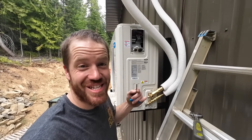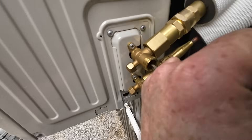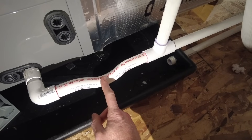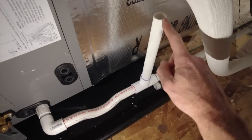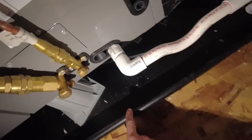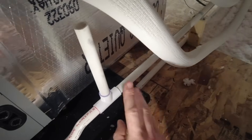With the line set hooked up, it's now time for the most exciting step, which is to release the refrigerant out of the condenser. You guys hear it? Refrigeration line's done. The next piece, and one of the final steps, is the condensate drain. This trap assembly fills up with water to prevent air from being sucked from the outside world into the air handler. This vent is an anti-siphon that makes it so the water exiting the building can't suck this trap dry. I located this vent over our drain pan so that if water ever came out the top, it would just land in the drain pan. This drain is slightly higher than this drain — so if the primary drain ever gets clogged, the water just comes out here and lands in the secondary drain pan. We have two condensate drains, a primary and a secondary, that both run to the outside of the building.